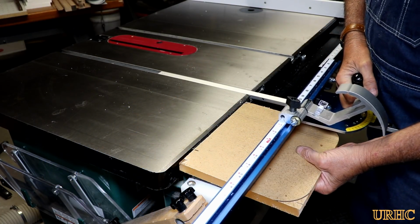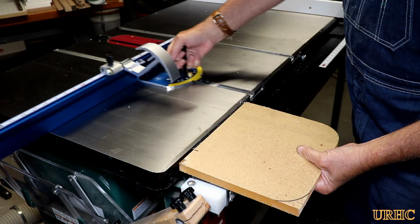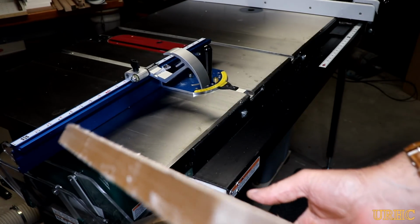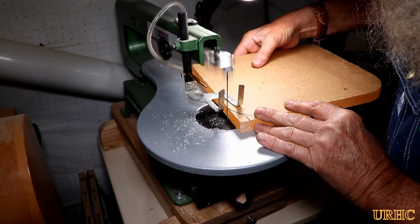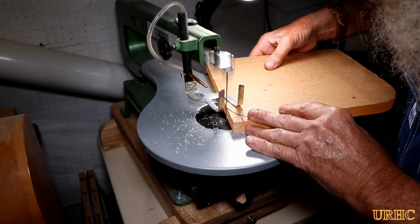And there you can see I just want to put a little shelf out front there just to hold the weight of that extrusion on the miter gauge from twisting anything when you go to cut wide. It is 3/4 of an inch, and I'm not quite sure what kind of plastic it is. I picked it up at a surplus center years ago, but I figured I'd use it for this.